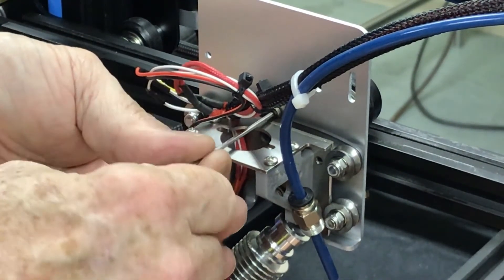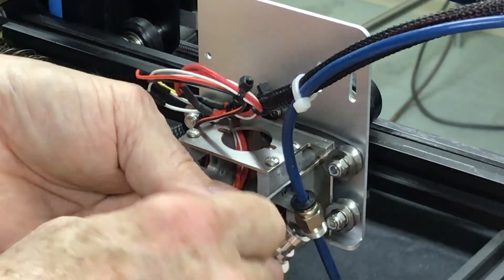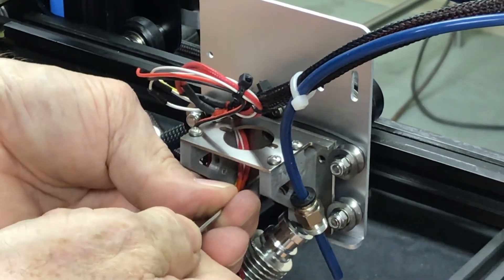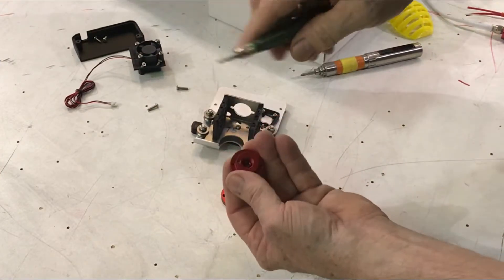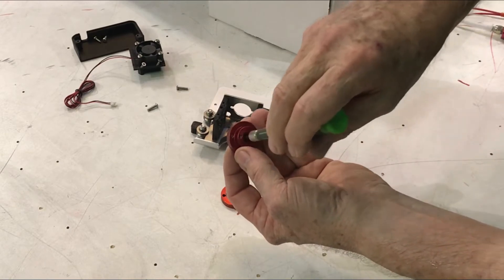You want to draw that up real slow. If you feel any pre-tension like a screw is stripping, stop, back out on the screw, and then go back in with it. Now cutting back to the CR10 hot end installation — I want everybody to take note: the hole inside of here is clearance for your Bowden tube to run down through.